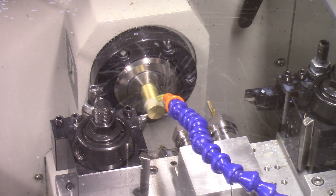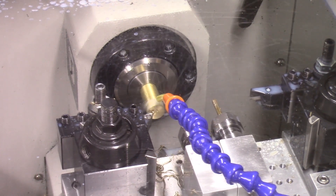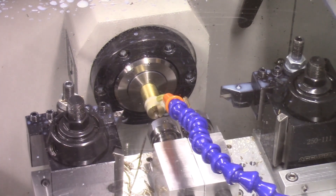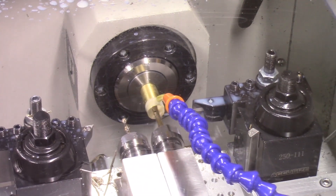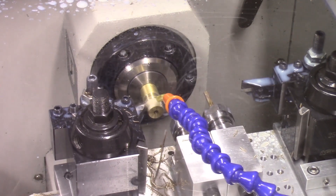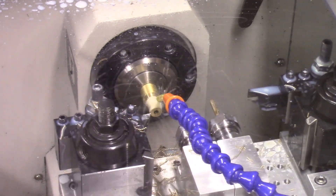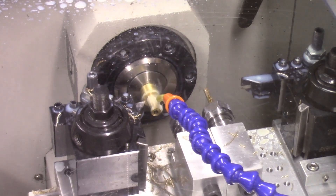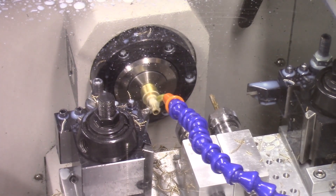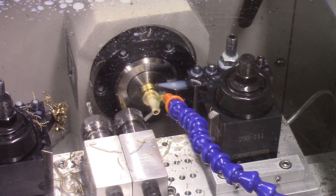Here we have the actual operating of the lathe. First I am using the front tool to face off the bar in two separate steps. Next I am using a number 19 drill to drill the center hole in the brass bar using a pecking motion. Next I am using the 10-32 tap to rigid tap the hole in the center of the bar. Then I am using the front right hand cutting tool to cut the outside profile of the brass offset cam nut, machining both the stem end and the base hub. Since I am using gang tooling, each operation continues with no interruptions or stops for tool changes, producing machine parts as rapidly as possible. The final operation uses the rear parting tool to cut off the cam nut to its required length.